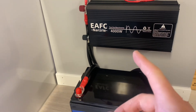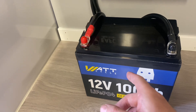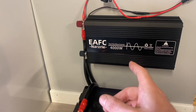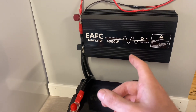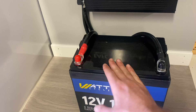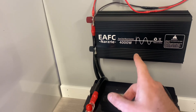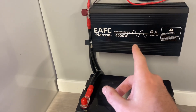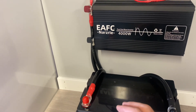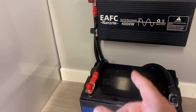This battery can handle about 1,200 watts continuous for one hour, and this is a 2,000 watt continuous inverter. What you could do is parallel another battery with this one to double your capacity, making it a better fit for this inverter — or use a smaller inverter like a 1,500 watt or 1,000 watt, which would be a better fit for one battery.